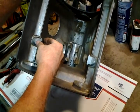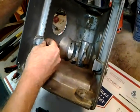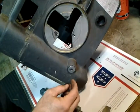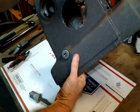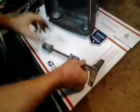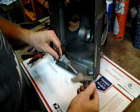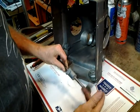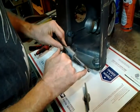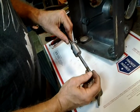When you tighten it up, both wedges come in and squeeze against the tubes. When you loosen them, they both slide out as far as they'll go, and you just see a disc portion of each wedge sticking out a little bit. The threaded rod is threaded in opposite directions so they go opposite of each other. The handle has a hole drilled all the way through the rod, and there's a roll pin that goes through the handle and through the rod.